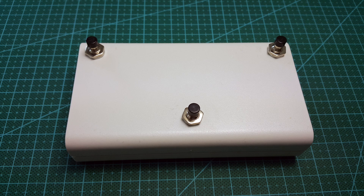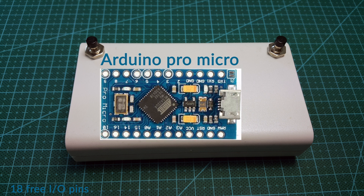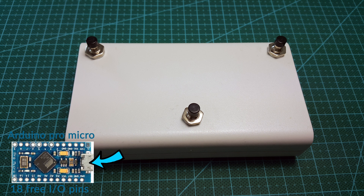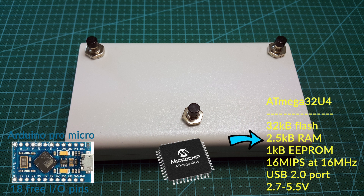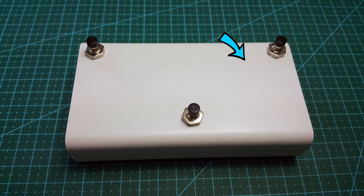Hardware. The keyboard is totally customizable. I decided to use Arduino Pro Micro due to its size and USB port — see the links in the description below. It has an ATmega32U4 chip, which means it has enough memory for the keyboard and has a hardware USB port. It has 18 free pins, so we can hook up to 18 keys directly. I only use three buttons for now.